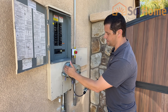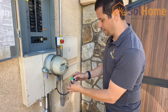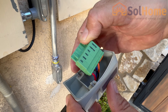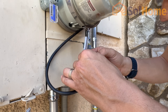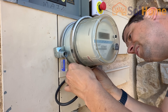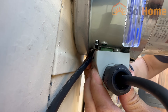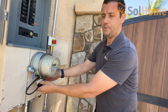So we just had the Tesla backup switch installed — they just left here a little bit ago. So I'm really excited; we can finally plug in our connector here. This is the communications cable that goes basically to the TACO that we just saw on the Powerwall inside the garage. This literally just plugs right up into the port on the back. Got it — that goes right up into there. And then once you get that on, all you have to do is put this cover on with three screws and you're done.